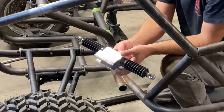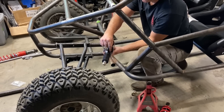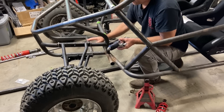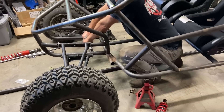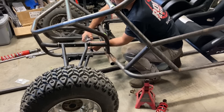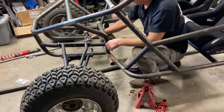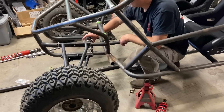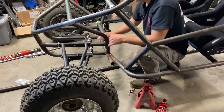Here we have it — a simple bracket made out of inch-and-a-half square tubing with a slightly thicker wall since it's holding the steering. I use rivet nuts in here. This piece is not tacked in yet; this is your steering support bar and this will just slide right onto it so you can adjust the height and center it perfectly, then tack it in place. Now I'm going to mark center, get it mounted up, and then get started on the tie rods. We'll make those up and then start setting up the steering.